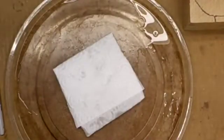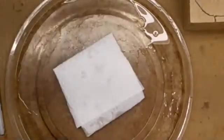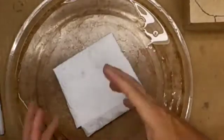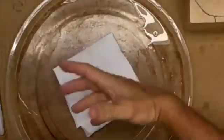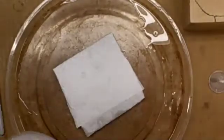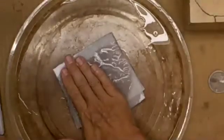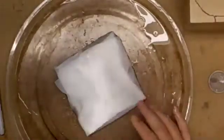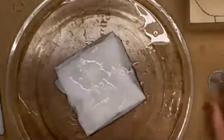You can do this in your microwave in your kitchen because it's not like you're drying wood or boiling wood. It doesn't make any smell. It doesn't hurt the microwave at all. The only problem is that you need to have clamps in your kitchen counter, because by the time you get the wood from your kitchen to your shop, it might be cooled off too much and not bending still. So I highly recommend getting a microwave for your shop. Craigslist, you can usually find them for about $25. I got mine 10 years ago for $25, and it's still working great. So good purchase, and it keeps me out of the kitchen and keeps my wife happy.